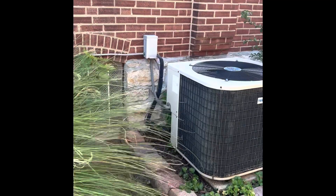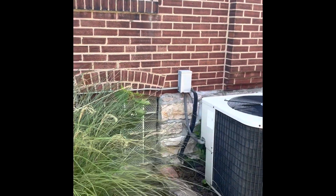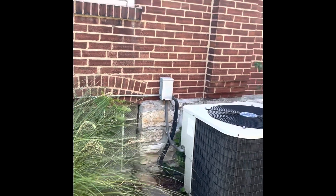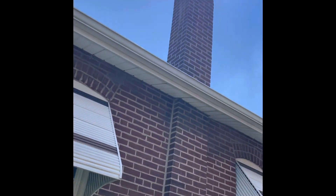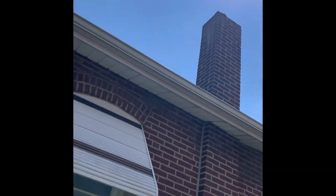That's it downstairs. We'll pull this outdoor unit up and set it back down in the same spot on a new pad. Disconnect box, electrical whip — and we're going to replace the line set rather than flushing and pressure testing. There's the chimney. We can do most of that ourselves, but we'll have to hire a chimney company when we put that liner in.